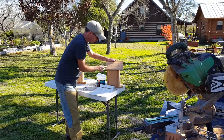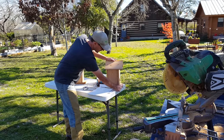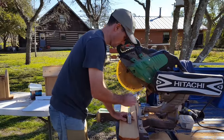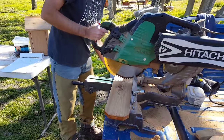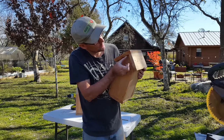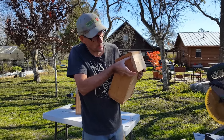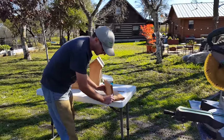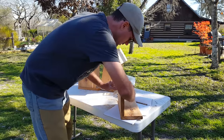I made the roof boards ten inches long so they would overlap on the front and the back. The overlap on the front will be about the same as the front porch, and then about an inch overhang on the back. Notice on the roof how they join up — this board has to be three quarters of an inch smaller than this one. This is the full five and a half inches, so we're going to take three quarters of an inch off of one of the roof pieces. I'm going to find that dimension easily by lining up the two boards and then just drawing a line on the inside.